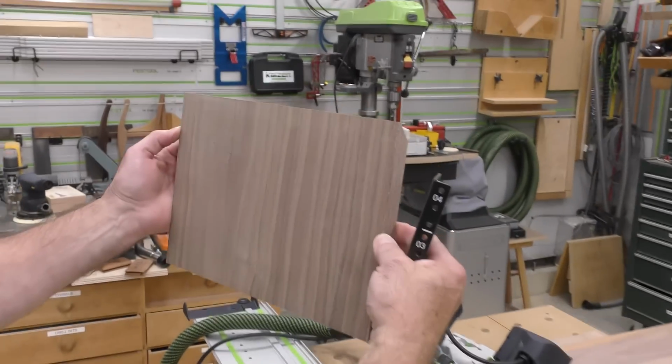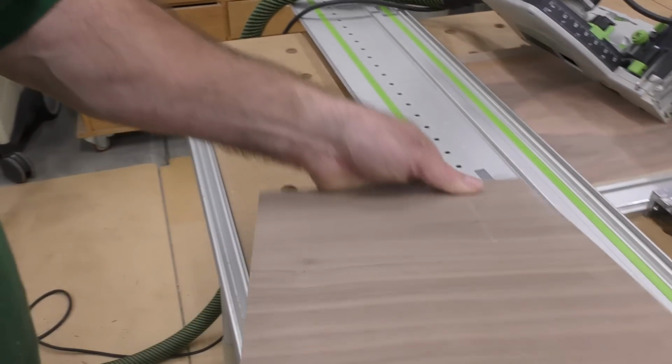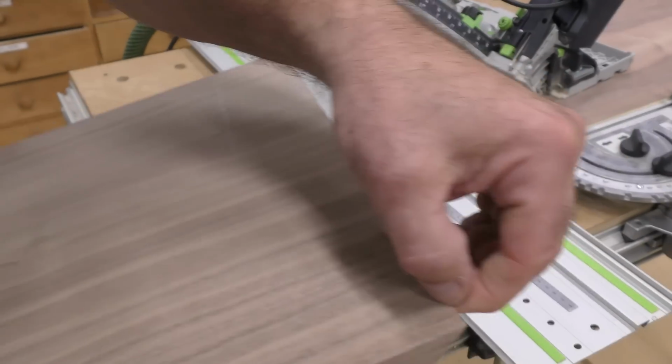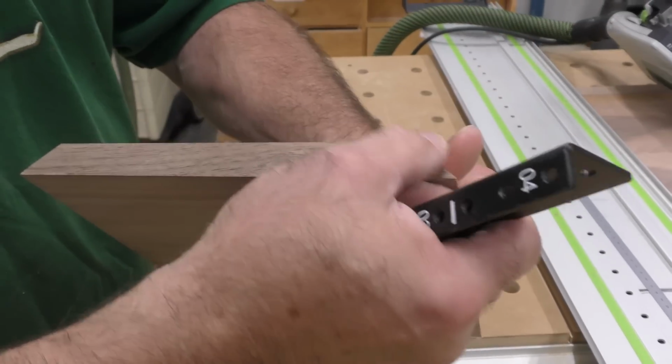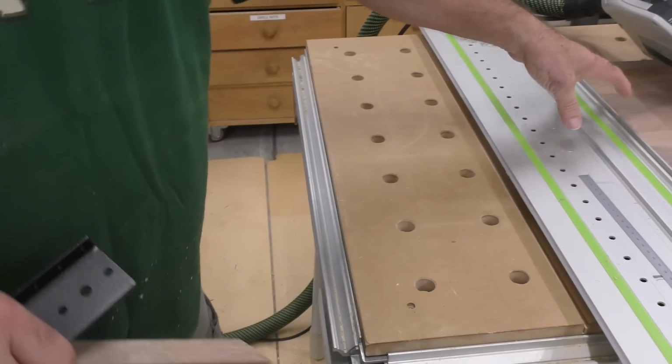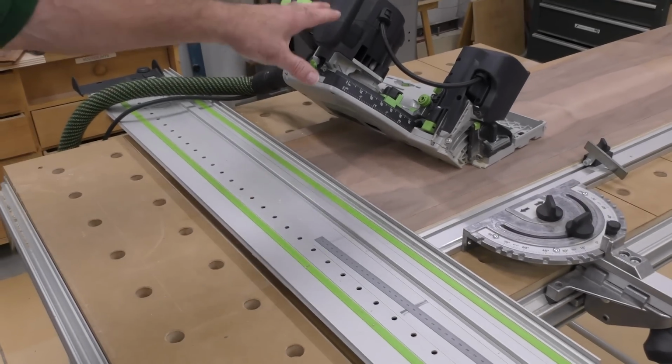So that's going to be my side piece, right? And from here to here, from the top, look at the bottom even, completely splinter free. That's what we just cut, and you'll see here all the way. It's the backer boards, it's the table, and it's the splinter guard. Combine it with a great track saw.